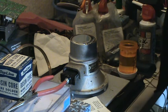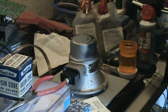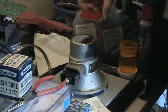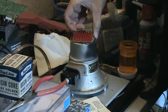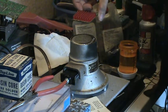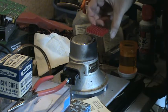You don't want it in there very long — remember, it only takes about five seconds to solder something. This board is actually too big so I'm going to have some of it hanging off the end, but here we go. It's 56 LEDs all at once. Looks like it bridged a lot of them, but I don't care.